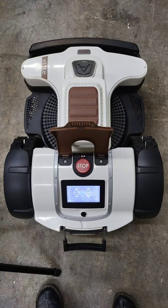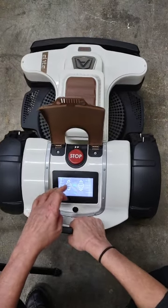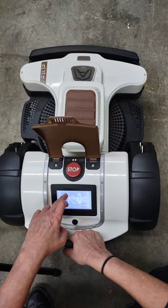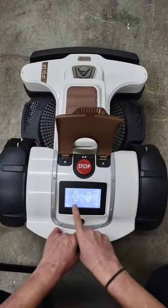Now I'm going to do the wheel motor test. This just involves ramping up the speed to 100% in the forward direction, and then again in the reverse direction, because the robot does go backwards when it's making its turns. So it's important to make sure that the wheel motors are working in both directions. I'm going to keep them linked together because this is just for winter service — you don't need to unlink them. That's more for advanced types of testing. So here it is at 100%.